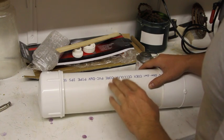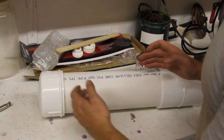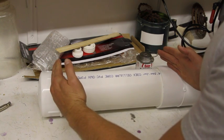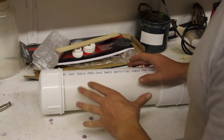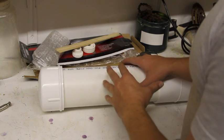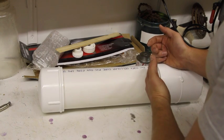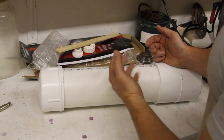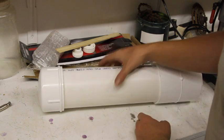As the pump size gets smaller, you can reduce the size of your pressure tank. For instance, the half inch pump that I use has a two inch pipe that is only about 15 to 18 inches tall. So you can vary that a little bit. If you go too small, the pump will not be able to build up the pressure it needs. And too big, it just takes longer for that initial pressure to build. So it's better to err on the larger side than on the smaller side.